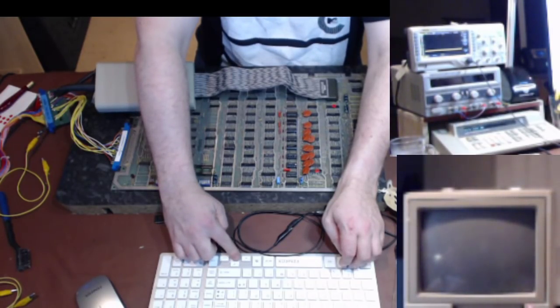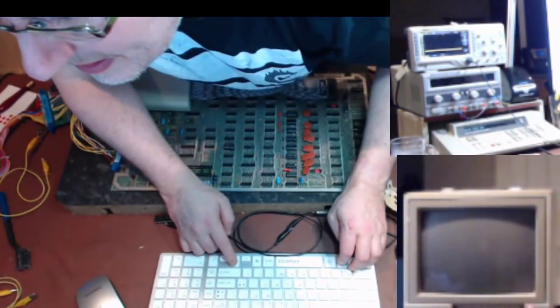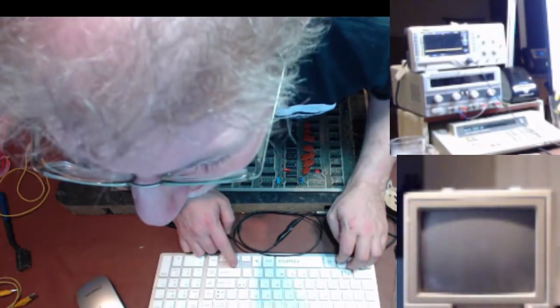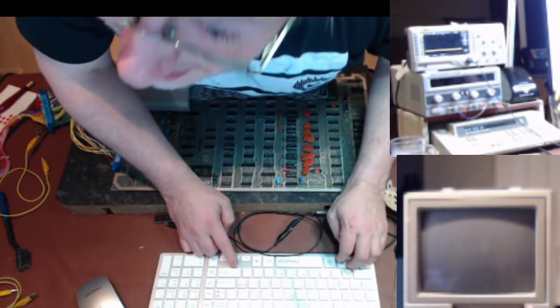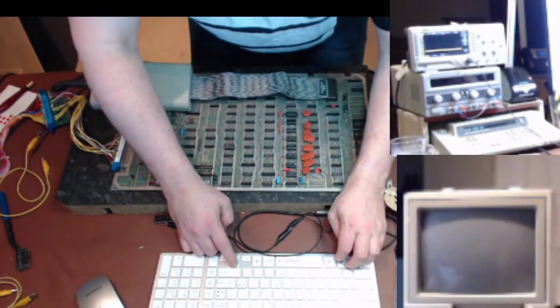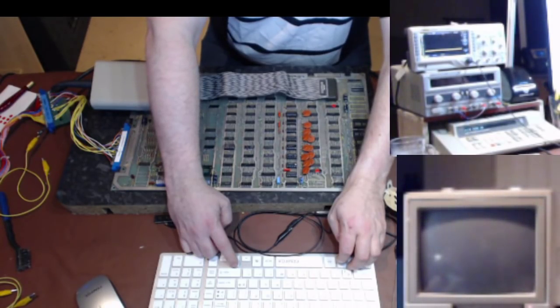So we find the actual DRAMs, and what we want is the D in and the D out. Right, so that's the D out, because these are one bit, so DO. There, where's your DI? Yeah, DIs come at... Nope, they're marshalled, so they come off MD. So this bit here, DRAM input, data input, so it's this block here which creates the MD signals for them.